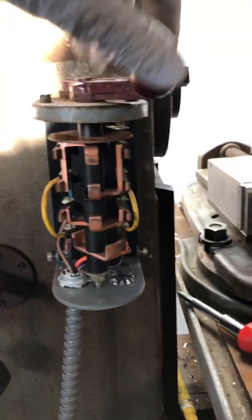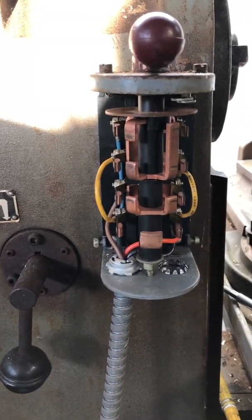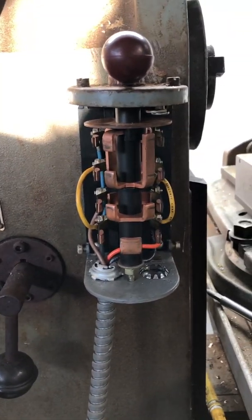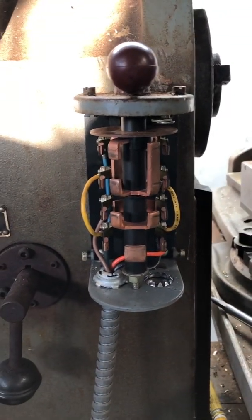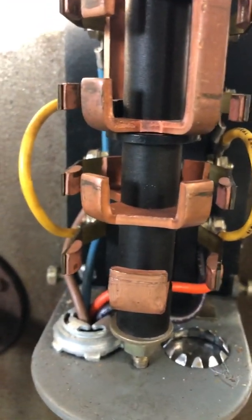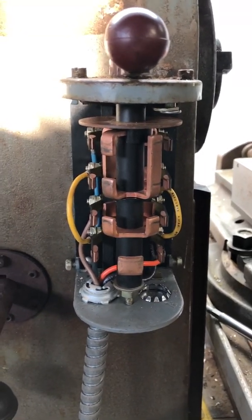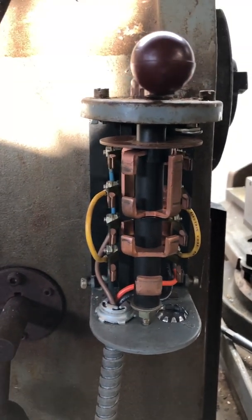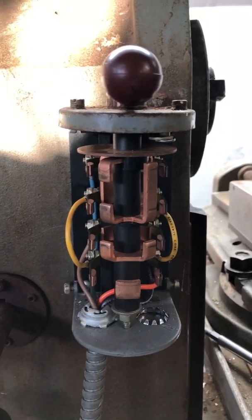It's going to function just like it always did — forward and reverse. I'm going to keep it old school, but with what I'm using it for it should last many more lifetimes. The quality of these things is just so ruggedly built. I think these are probably vintage mid-60s to early 70s, and the contacts are barely worn at all. Thanks for watching — we'll get into more wiring as I hook up the VFD. If you've never seen the inside of a drum switch, now you have!